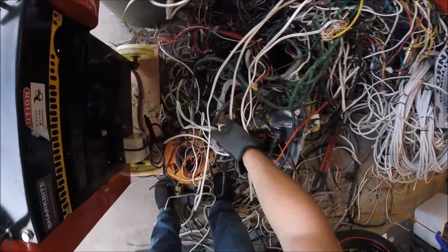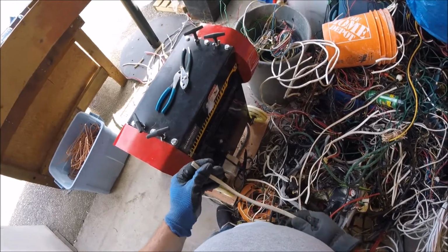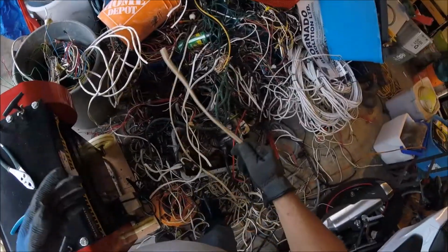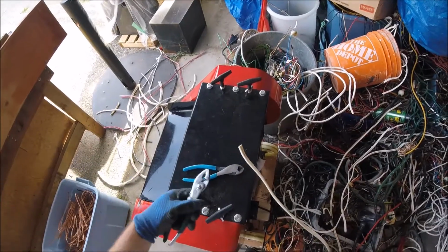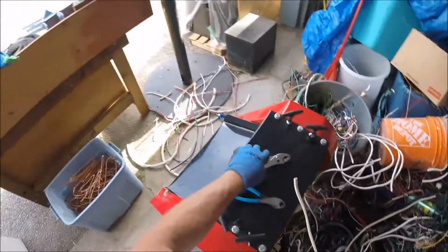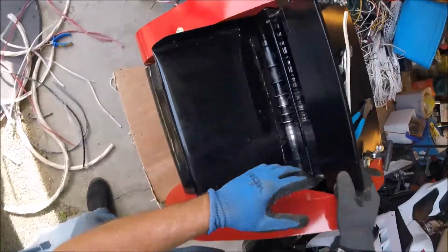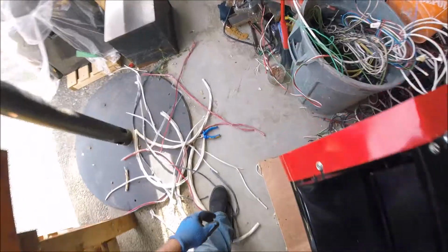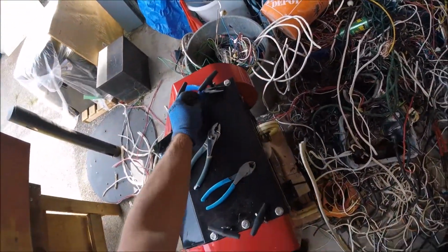So what I'm doing is, this is Romex, your standard 14 gauge house wire. You need these tools, by the way. You need a cutter to cut your different lengths, a bolt cutter for the really big wire, pliers like this to pull the stuff. Sometimes it spins around and you've got to pull it out. And there was another needle nose. I had a piece of wire that was stuck way in there, spun around about 5 times, so I needed a needle nose here to get it out.